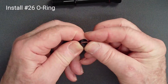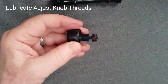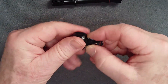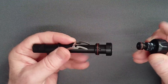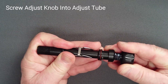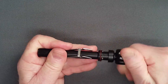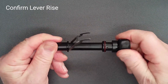Install a lightly lubricated O-ring on the knob. Lubricate the knob threads. Using a slight rocking motion to slide the O-ring past the sharp inner threads of the adjust tube, insert the knob. When the threads engage, screw the knob in. The lever should rise and you should feel spring tension in the lever.